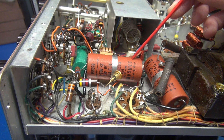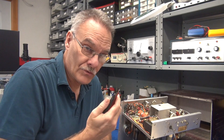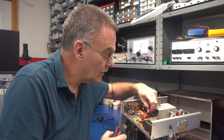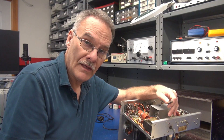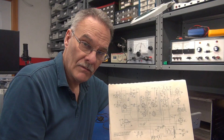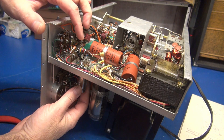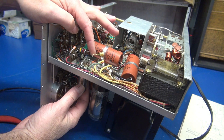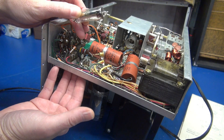I'm going to put in some fresh filter caps and then we'll try to power up the Navigator. What I do in this case is grab my wire cutters and carve out the modifications. There's no reason to try to diagnose a radio that's been modified when you know it worked great when it was stock. I'm going to remove all this stuff, go through the schematic, put her back the way she was, and then we'll test it. I do find it comical that somebody would get in here, take the lugs off of the tube socket, disable the filaments, do the diode mod — but still have this 6X4 rectifier plugged in like it's really doing something.